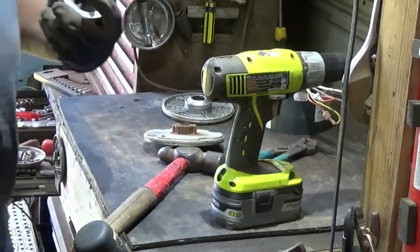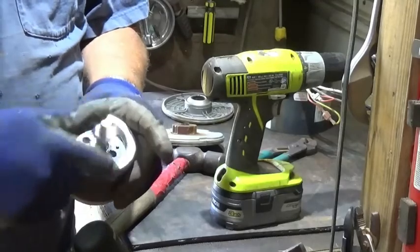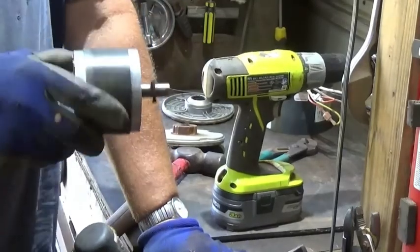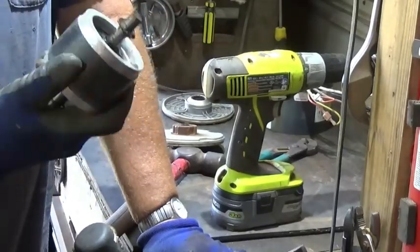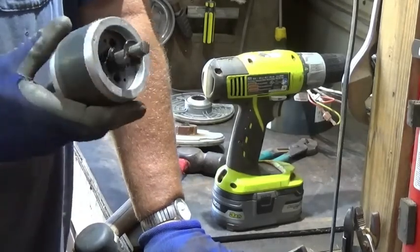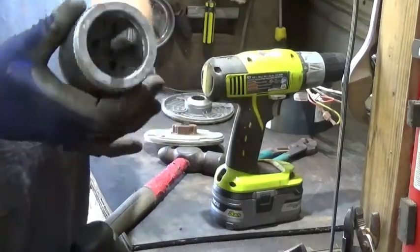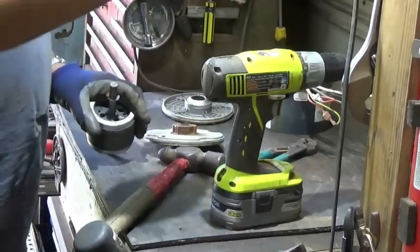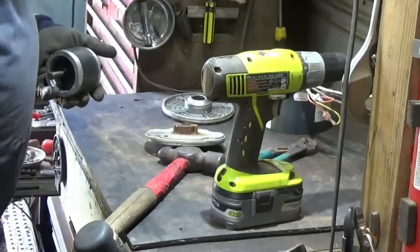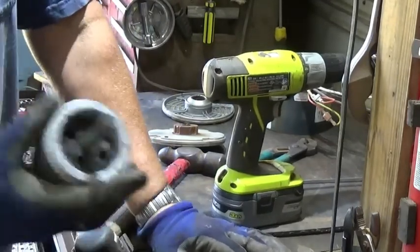Now, some of you that have been following my channel know a lot of times I like taking these because I look at all that aluminum. I thought, man, there's a nice chunk of aluminum there. So that's part of the reason I built that waste oil burner, where I could try to melt that off of there. I'll throw this in a bucket over here for aluminum to be melted. I'll melt the aluminum off of it, and then I'll throw that in tin. Then I can take that aluminum and make ingots out of it. And the plan is to sell those ingots on eBay.